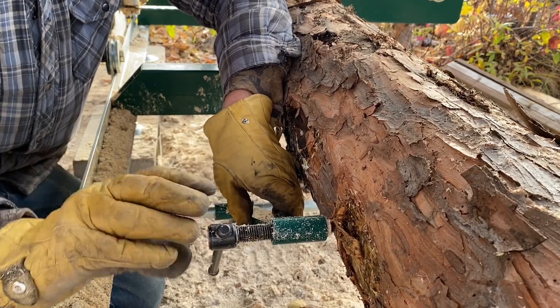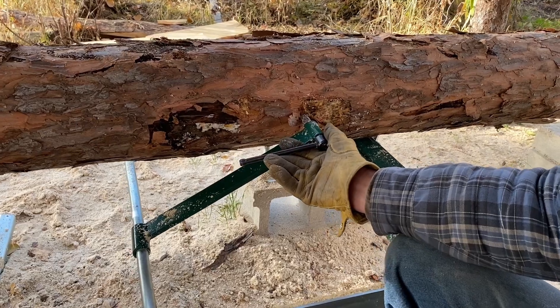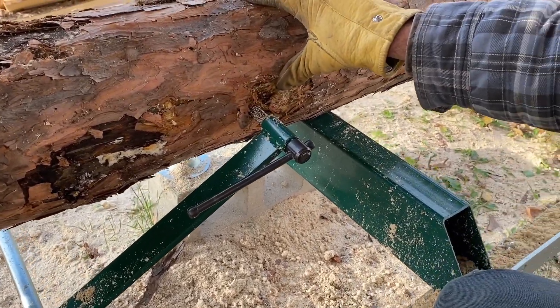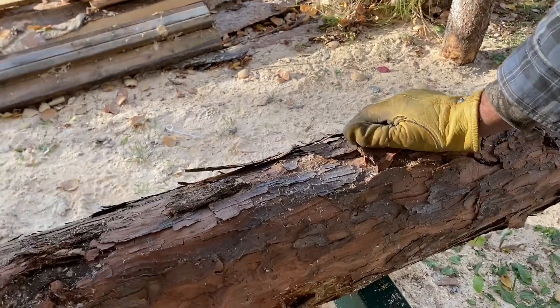This is your log dog here, and this is very important. You always want to make sure it's nice and tight, as tight as it can be, because if there's any play whatsoever in your log you have a potential chance of breaking a blade. These are your log supports.